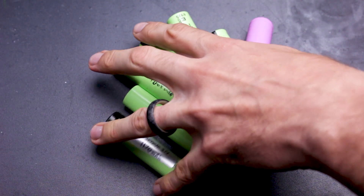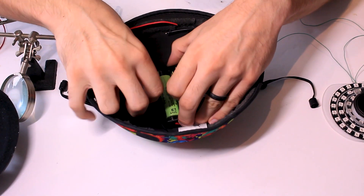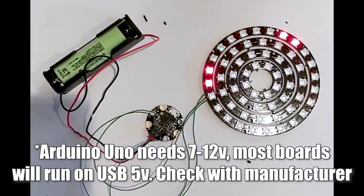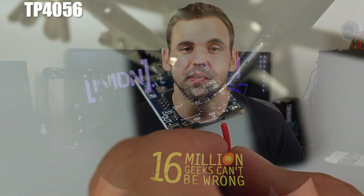If your project is going to be mobile, batteries will be your only solution. I'm a big fan of lithium-ion batteries — in fact I've used 18650 batteries just recently in my Mickey Mouse ears project, using two in parallel to get 3.7 volts. If you're looking to power an Arduino board, 3.7 volts is what you want and that's about what you'll get from an 18650 battery. What I like about 18650 batteries is that they have a large capacity — they're just slightly bigger than AA batteries yet they're so energy dense, they're perfect for a lot of projects.